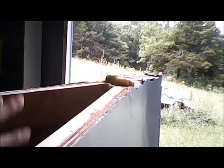It also provides strength at the bow, because now you've got a nice big piece of wood up here that's going to tie both the shears in and make this really strong. Down there is extremely strong with all the reinforcement and epoxy at the bottom of the bow along the stem. So I'm going to come over here, get dimensions, and build a breast hook today. Much like I did with the knee, I'm going to laminate it using that old thick epoxy — for laminating purposes I think it's just fine. And when I put it in place, we will of course use the regular thin resin epoxy.